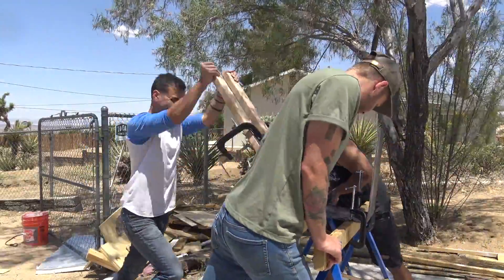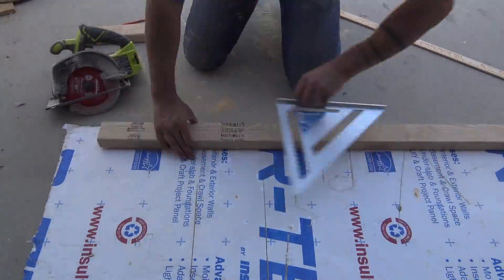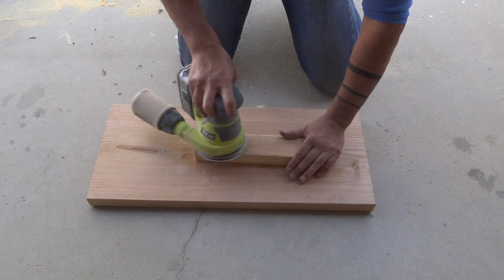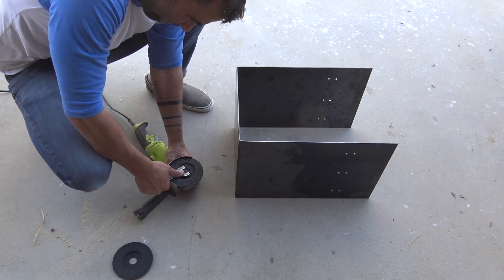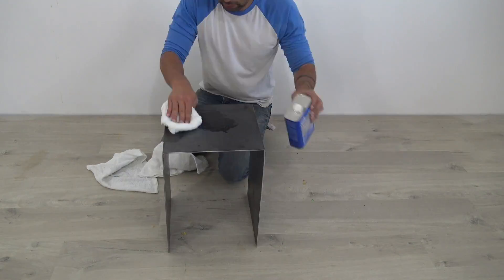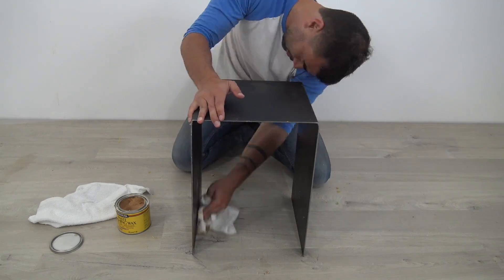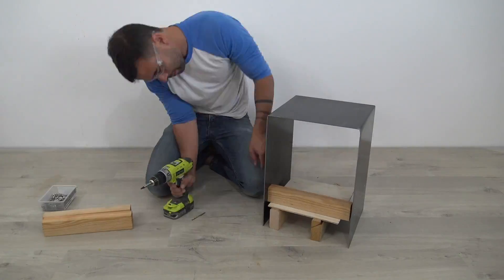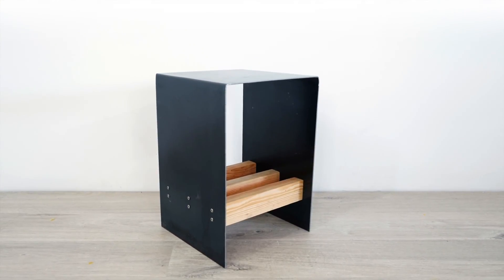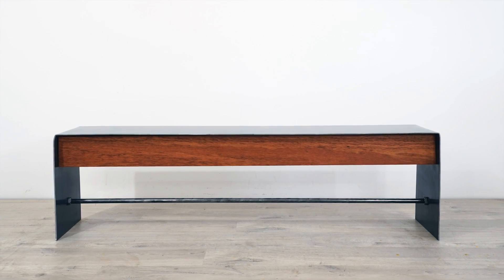We repeated the process on the other side and were able to get two nice relatively perpendicular bends. For this bench — or maybe it'll end up being a night table — I ended up using short pieces of a 2x3 to make the supports. This time I tried rounding over the edges with an angle grinder and a flap disc, which worked a lot quicker than the orbital sander. I cleaned the steel with acetone and then sealed it with paste wax. I screwed into 2x3s and I'm pretty pleased with this nice little bench or side table. So these experiments are going pretty well, but I want to take things to the next level. But before I show you these evolutions, let me tell you a little bit about the sponsor for this video, Fracture.